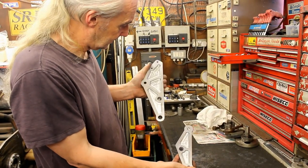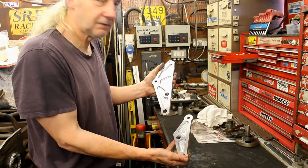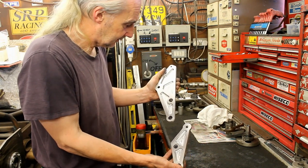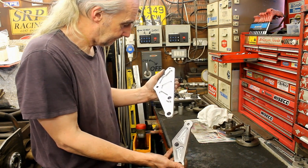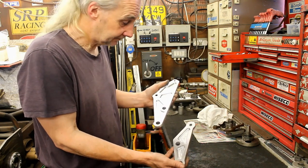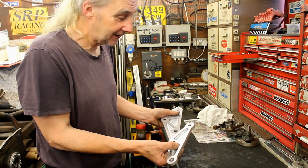When they were made, they were just like big slabs of ugly metal to me. Flat plate. And they're big because we had to raise up the pegs, and the mounts are quite low, so the whole thing gets longer and longer. Didn't look very good on the bike. I'm going to get these hard anodized black just to hide them a bit more. But in addition to that, let's do a bit of milling, with rotary tables.